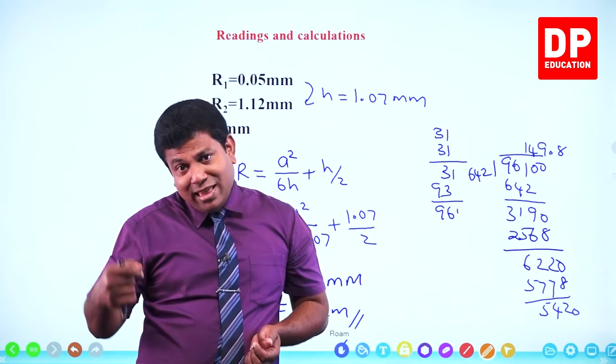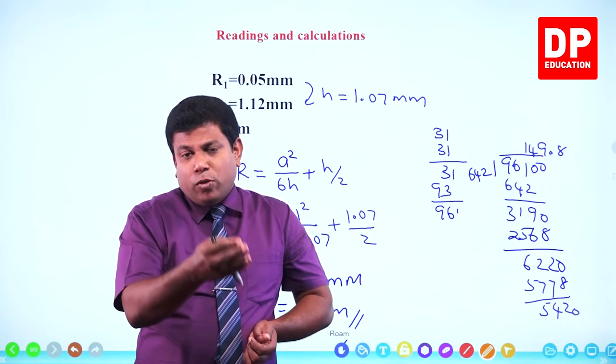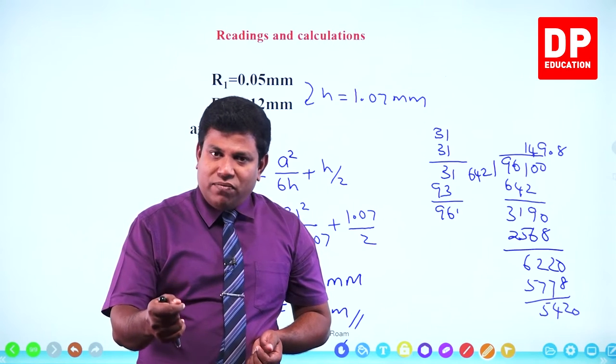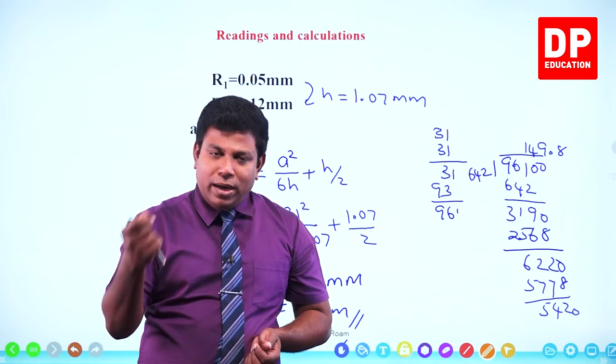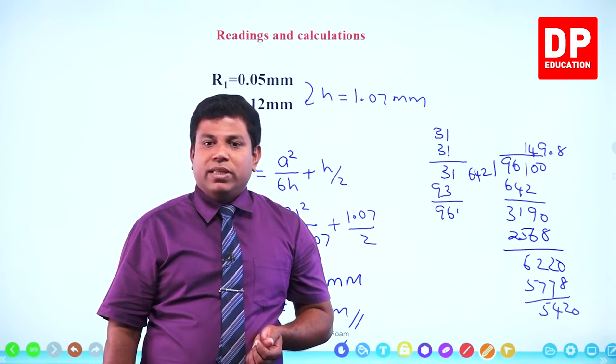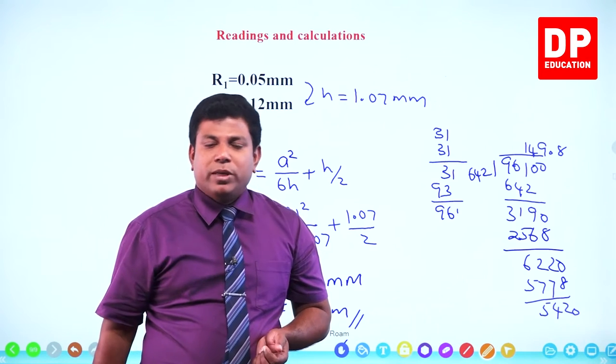Spherometer, right? The thickness, of course, you can measure with anything, right? Micrometer screw gauge also has similar accuracy. So thickness of, say, the glass slide, you can measure with this or the other one. But curvature radius, you can't measure with others. Clear? So, that's all about this simple instrument of measurement.